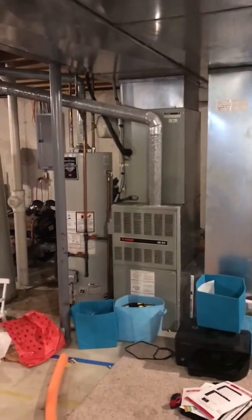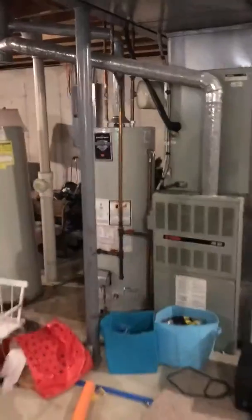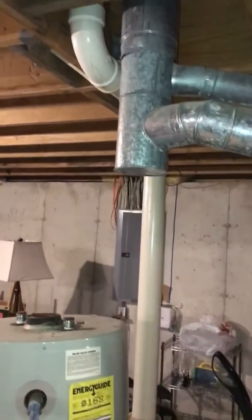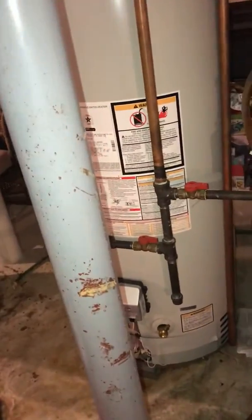In the basement at Mike and Mary Beth's house, we're looking at a furnace and AC replacement. It's an 80% furnace, Trane from 1994. We've got a four-inch flue running into a five-inch liner, so we're going to need the four-five T cap on the bottom. We have an isolating valve on the gas, with drains nearby.